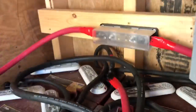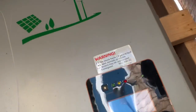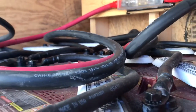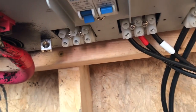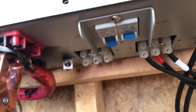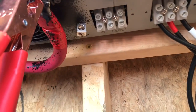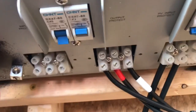This is a 200-amp ANL fuse block. On 48-volt systems, the fuse will need to be sized appropriately to the size of your inverter. With all-in-one inverters — where the charge control system and the inverter are combined — you have a negative and a positive terminal for your battery bank, then there is an input from the utility company. Sorry it's a little messy in here; this is just the unit we move around for construction, but I'm using it as a teaching tool. Most inverters have two hots and a neutral.